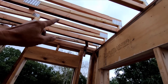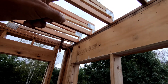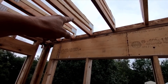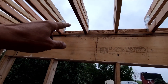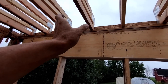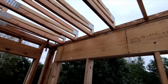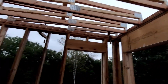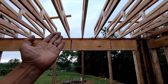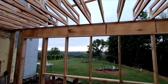Then I can get started on the trusses. What I'm going to do on the trusses is loosen them up one at a time, pull them over until they're touching the rim board. You can see where I have their locations laid out on the rim board there. I'm going to pull them up tight against that, pull them plumb, and screw them in. Once I have all of these done, I can go to this side, do a little bit of shimming, and then put the rim board on this side. Hopefully I can get this done today.